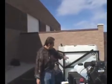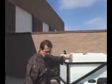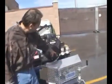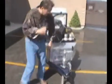As far as hauling water to and from the job, a lot of guys will dump their water and then refill, but time-wise, I just hear it's nice to have a bigger tank and have a trailer that's actually DOT rated to haul the load. This trailer's 7,000 pounds rated, and it's got the breakaway, which you usually see on the 10,000 pound, and it's dual electric brakes. Got the big ball, 2 5/16 ball.